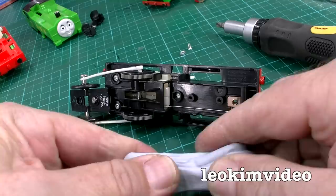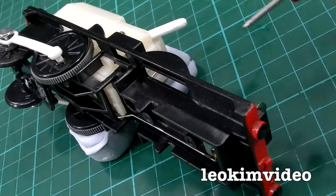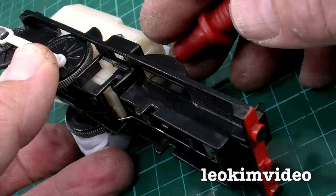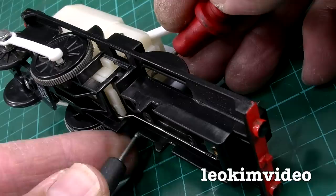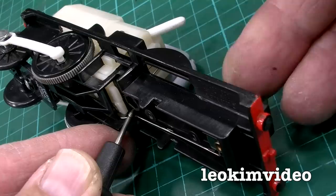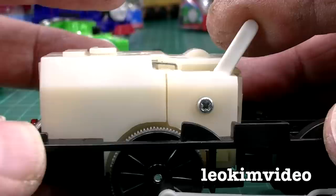Let me test this side of the circuit here, to the positive end of the battery. What's always my friend when I'm making videos is blu-tack — so I can sit duck there and he doesn't move; now I can come in and probe him. Circuit testing time — let's check that we're beeping. I'm putting the probe up on the positive side of the battery terminal and coming in to probe this other side. Not hearing a beep there. I'll put the probe up on the negative end — okay, hearing a beep there, so that joint is okay. So we're starting to work out this side of the circuit is okay. The problem resides somewhere here — it's either the switch or the connection of wire up on top of the motor.